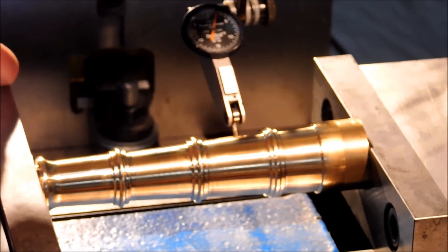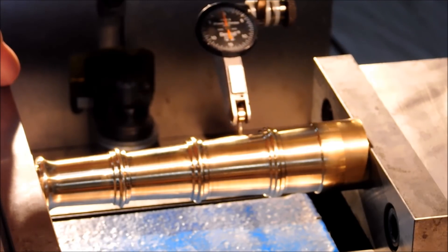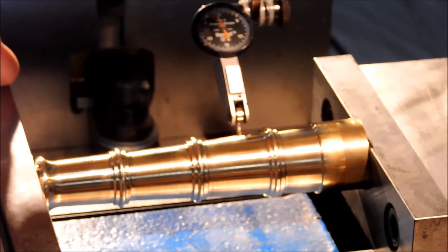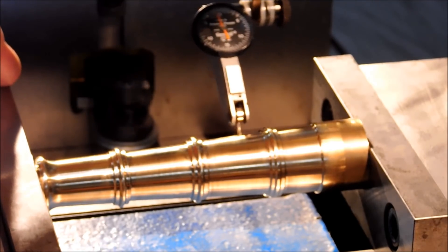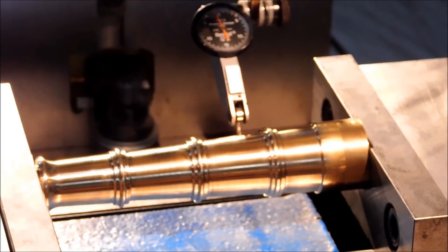I'm going to lock it in right there. I'll spin the spindle by hand and watch what happens — it drops down to about minus a half both ways. Right there where the needle doesn't move, that should be your zero, which it is. If you have a digital readout, zero it right now — provided it's turned on.